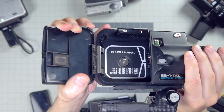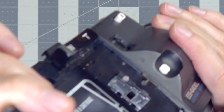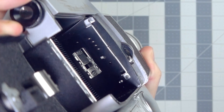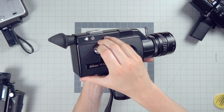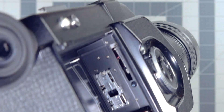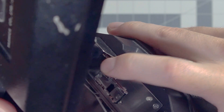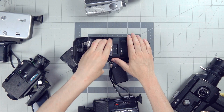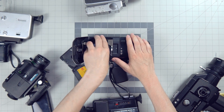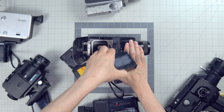Sometimes the camera might only handle film up to 160 ISO and it only has one pin inside of it. This one has four pins — great, that means a good range for auto exposure. This Nikon here, a beast, it's got this slider. This Hishika, a staircase. Sliders and staircases are good, so are multiple pins. Watch out for those single-pin cameras that only have auto exposure, because they won't play super well with those fancy 500 ISO films, leading to some overexposure usually.